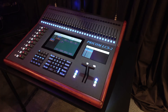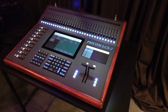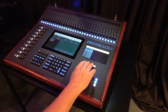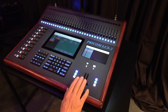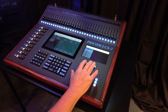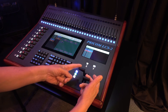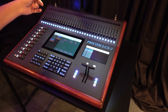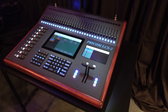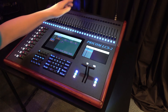And then I can also direct enter a fixture number or a preset number and get to it quickly. To the right is our manual T-bar. The LCD displays the cues that are being run on the T-bar. As I pull through the cues, you'll see the bar slides to indicate my fade. I can do a split fade where I'm doing a lead and a lag so the next cue comes in before the previous cue goes out. We also have two overhead cue lights, which have adjustable intensity, and a USB jack for putting in a removable storage device, keyboard, or other such things.